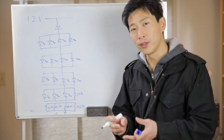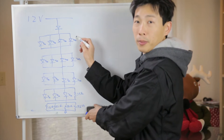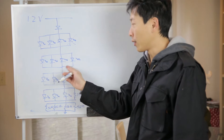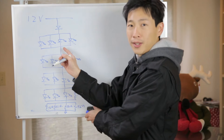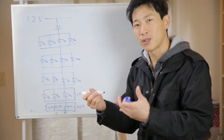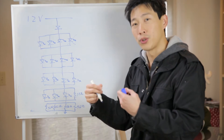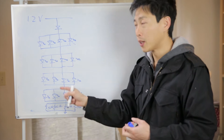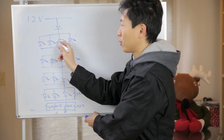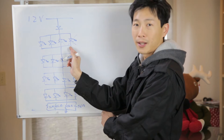Let me explain how these things fail. One of the major causes of failure is one of the LEDs breaking open (short open). When one breaks, you're still supplying power to the whole thing. The remaining LEDs wired in parallel each get about 33% more current going through them, so they're being overdriven and stressed more. Eventually one of them breaks, and the rest get even more current because they're all in one long chain. These will fail much faster due to the extra current, and after a while another one goes out, driving the rest twice as hard.